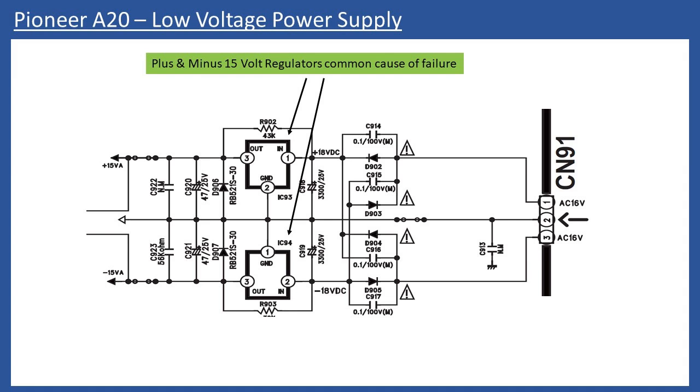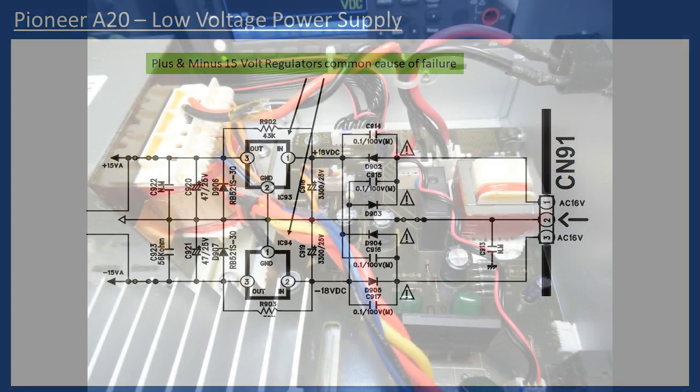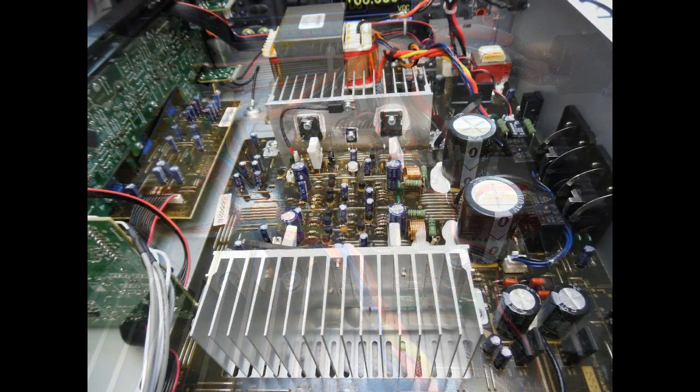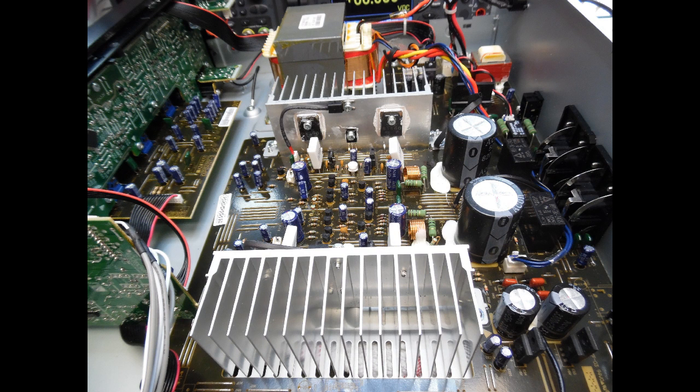In some cases you may have no output at all on either regulator, which brings us to the second most common fault: failure of the primary winding on the toroidal transformer. You'll know straight away because there'll be no DC input to either low voltage regulator. Less commonly, when you look at the standby power supply board — where the mains input comes in — there's a small transformer generating 3.3 volts sent to the microcontroller on the front fascia. This is permanently active and enables the amplifier to switch in and out of standby mode. When the amp powers up, the microprocessor sends the command and the startup board energizes the power relay, providing power to the primary of the transformer. If there's no DC offset and no missing voltages, the amplifier runs as normal.